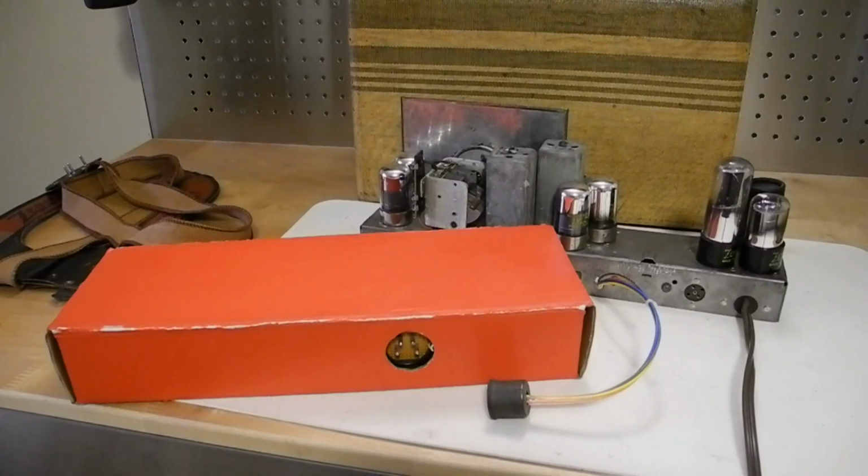There are also replacement batteries like this one that I purchased for my H500 transoceanic. This unit takes 10 D cells and uses circuitry to generate the 9 and 90-volt supplies and works for many hours of use. Unfortunately, the radio is not working with this battery. It seems my battery unit only puts out about 7.8 volts for the 9-volt output. Unfortunately, I don't have a schematic or other technical information on the battery and its circuit, and they're no longer being made.